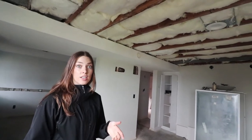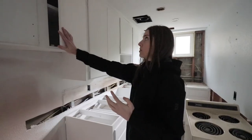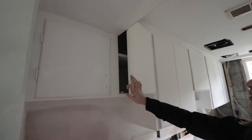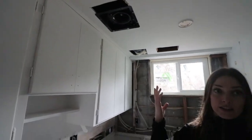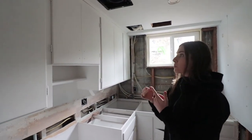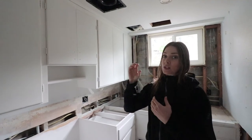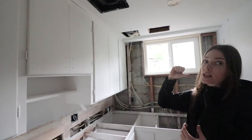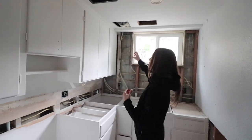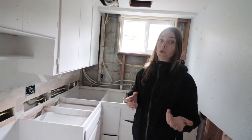I hired Bolton Insulation, which is a local provider, to install all the insulation. These have not been painted yet, but they've been preparing — they oiled them and took off all of the handles. The electricians install the fans and per code they are required to be in kitchens, laundry rooms, and bathrooms. My lesson learned is that they installed the vents, but they don't connect the airway or the airflow that exits the house. Where they were originally installed, at least in the bathroom, there was no way to route that outside, so they had to be rerouted. Make sure that your HVAC tech and your electricians are talking to each other, or at least talking to you about where they're putting them.